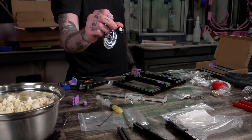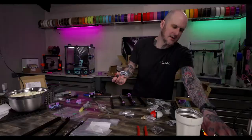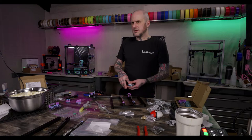It doesn't need hot tightening. No, you can't get to it too hot and tighten it. It had a 20 millimeter fan on it. So currently the square frame is running in my 2.4 with a 40 millimeter fan blowing through it. I also only really run ASA and ABS through that machine. It's printing right now. So that's a lot more tolerable of heat creep, I find.